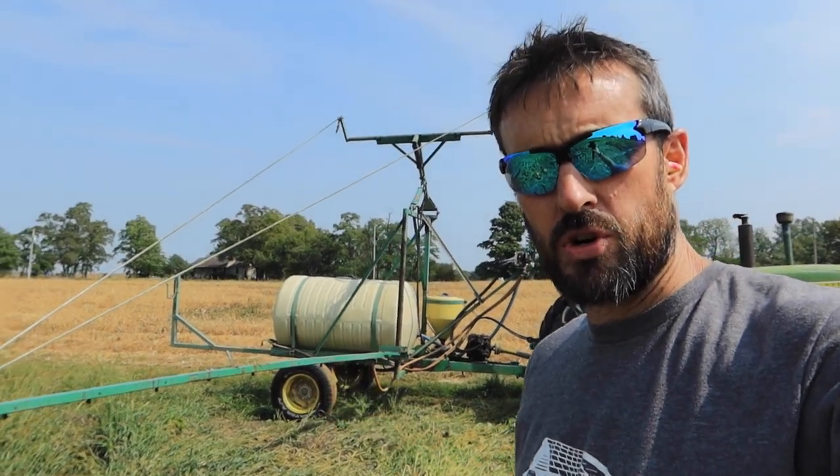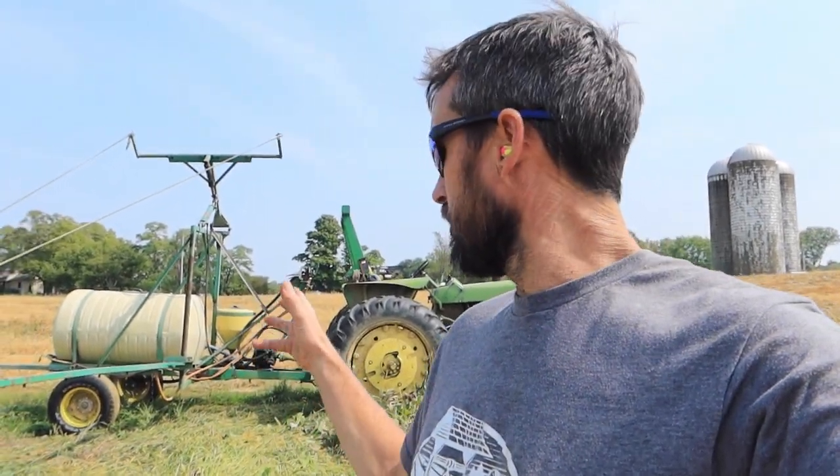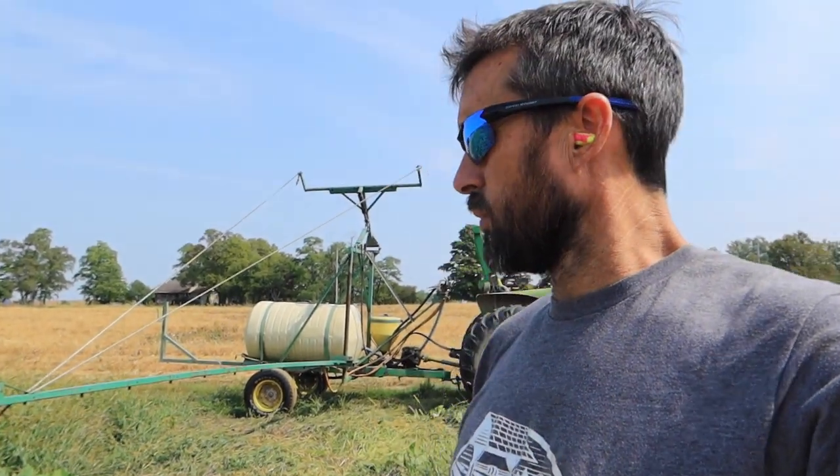Another unique feature about the high-pressure single-sided boom sprayer is that it puts down a lot of gallons per acre, and that's what you want when you're trying to get your nutrients and pesticides down into the crop canopy. Today I'm driving five miles per hour and putting down 38 gallons to the acre — a lot different than spraying herbicides on a large grain farm where you might be spraying five to ten gallons an acre going 15 to 16 miles per hour. For a pumpkin crop, we really want to drench these plants, pumpkins, stems, and vines with the nutrients and pesticides we're spraying.